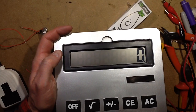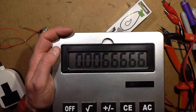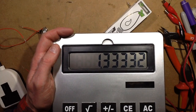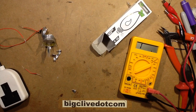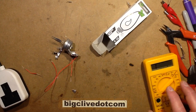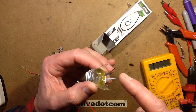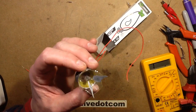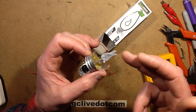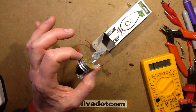200 volts across the resistor times 6 milliamps equals - that resistor was dissipating about 1.3 watts, which is quite a lot for that little resistor. I would rate the resistor at about half a watt, so it was being grilled in there - it wasn't having a good time. This electrode is going whiter - it's definitely oxidising, probably covered in some toxic powder. So if you know what's involved in these electrodes and what this coating is that creates the flicker effect, leave a comment down below. That was quite fun, I actually quite enjoyed that.